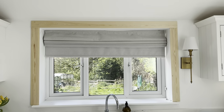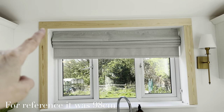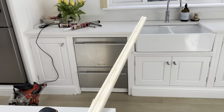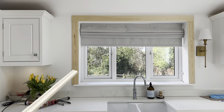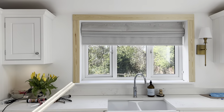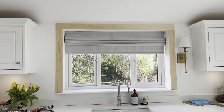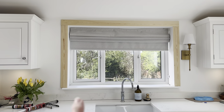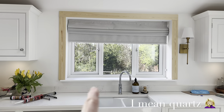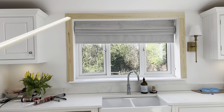That's all on now. I'm going to double-check the measurements of this piece — I think it's 98 cm — then cut some of the stripping and add it either side to give a bit more detail. Then I'll be cutting the top piece, which is going to have a 45-degree angle so it has a bit going back as well. Then I'll sort out the bottom bit so it goes all the way around. I haven't got much of a gap there because of this marble strip. Now I'm going to measure up for this trim to make it more ornate.